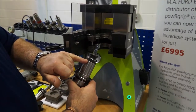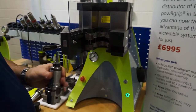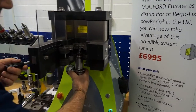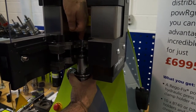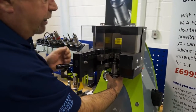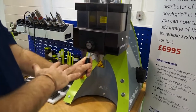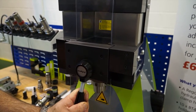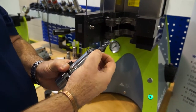We talked about this groove on the top of the holder, and that's the only thing this system relies on. Down here it's irrelevant — we don't have to change adapters down here. This groove sits on that shoulder there. As you can see at the top, there is the press unit. As it goes down, it will go onto the top of the collet and force it into place. By the simple press of a button, the press comes down. Then take the tool assembly out and as you can see, that gap has now gone — it's been pressed down into position.